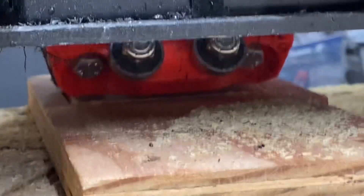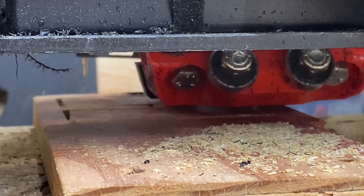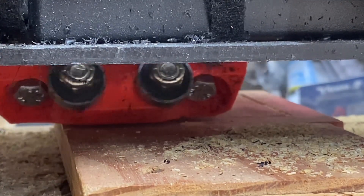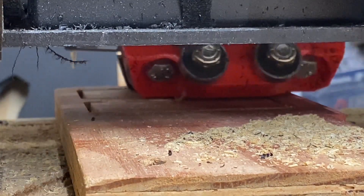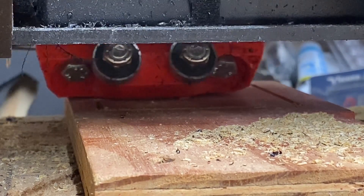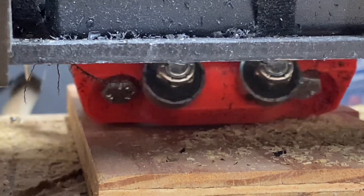In the midst of that, one of the things you have to figure out is whether or not your design is going to succeed as far as the cross lap joints that make the torsion box go together. I had a question — not having a lot of woodworking experience — about whether there's supposed to be an allowance or tolerance where you cut the notches a tiny bit wider than the plywood thickness, or whether you go for the exact thickness. My research found that the best fit is to go for the exact thickness.